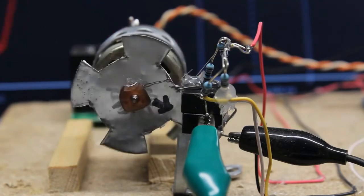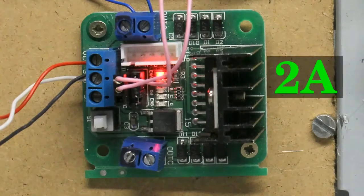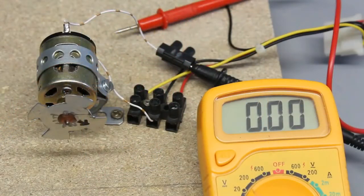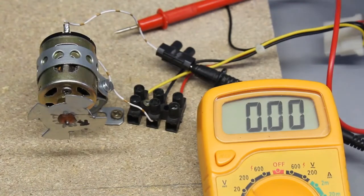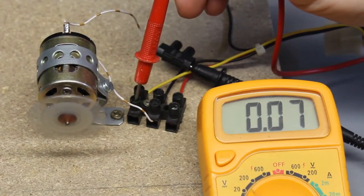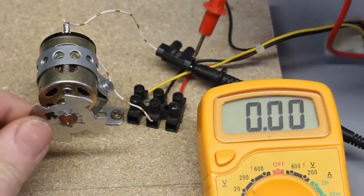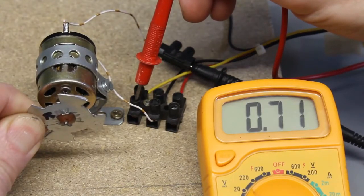What type of DC motor can be used? That's mainly a matter of the H-bridge used. This board has a double H-bridge based on the L298N chip with a maximum continuous current of 2A. Using a digital multimeter in series with the motor, you can measure the current. The motor runs at 60mA idle at 5V and 70mA at 12V. The maximum current when the motor stops under load reaches almost 300mA at 5V and 700mA at 12V — well within the H-bridge rating.